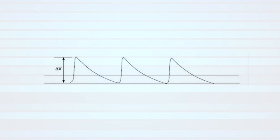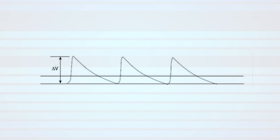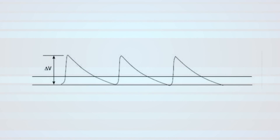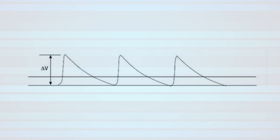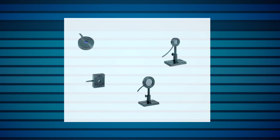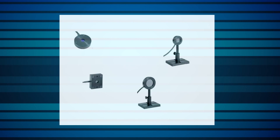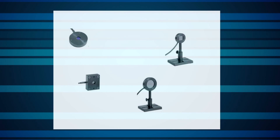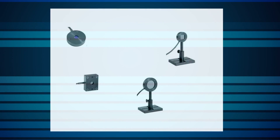The sensor offers direct connection to the raw signal of the pyroelectric detector itself, where the output voltage is proportional to the laser pulse energy. These sensors have no electronics, with the exception, if needed, of some passive components for adjustment of the sensitivity. The sensor can be offered with or without a measured calibration factor.